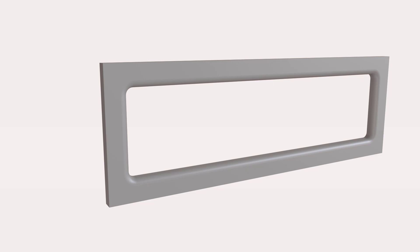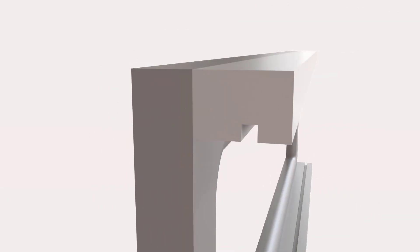Next, we have the top and bottom borders. The borders are made out of half-inch MDF, three-quarters of an inch deep. Here are all the measurements for the slot: at the front of the border we have a quarter-inch space, then the slot at 1/8 inch by 1/8 inch, and the rest of the border at 3/8 inch. The slot width may need to be wider depending on the acrylic and artwork you choose. I made my slot just 1/32 of an inch wider than 1/8 inch because I'm using two pieces of 1/16th inch acrylic and a Translite film.